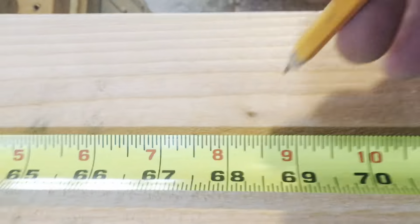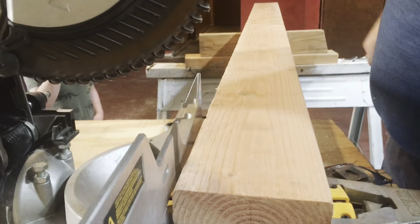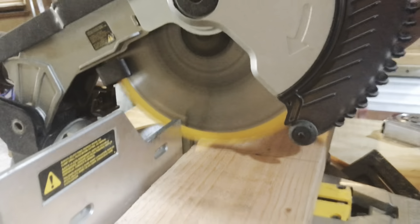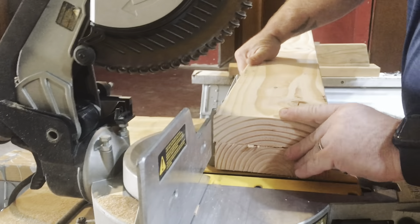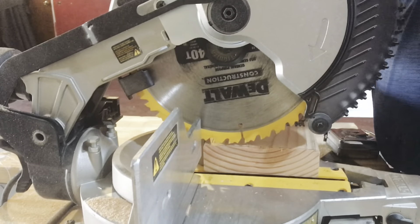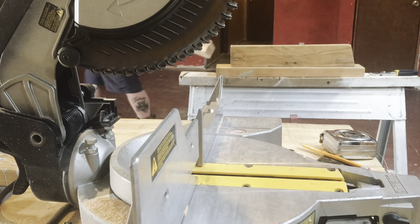You have to make them really sturdy. On the top platform, you want a board every 12 inches or so. On the bottom platform, you're just holding the top platform, so you only need the long-ways boards — about three going across on the bottom and six or seven across the top, depending on what size bed you're making. These are going to be full size beds, graduating them up from twin mattresses. Whenever you get lumber from the lumber yard, make sure you take out all the nails and staples so you don't tear up your blades.